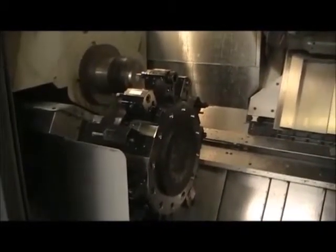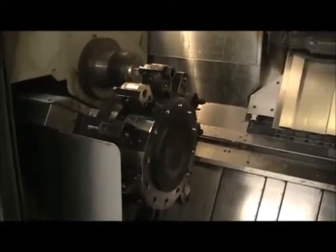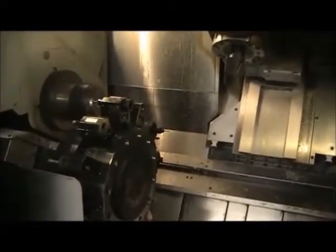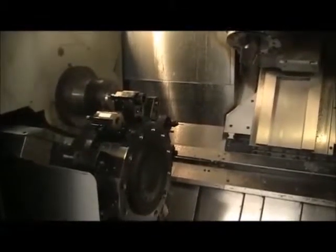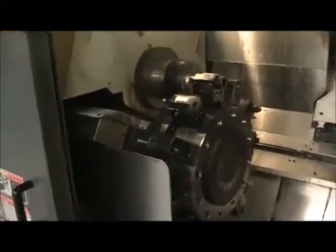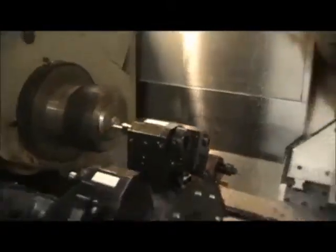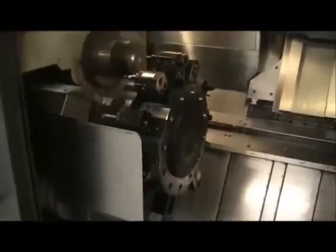What's the RPM right now? Head one spindle — 2,000 RPM. Extremely quiet on the spindle. Ball screws are tight. Very quiet. Turret indexing is excellent. Holding two tenths tolerance on the previous part. I'm going to bring the part down to show you.